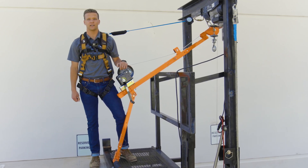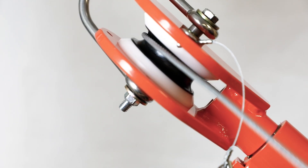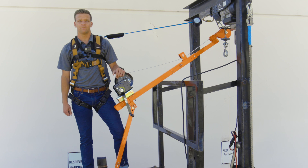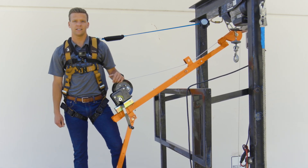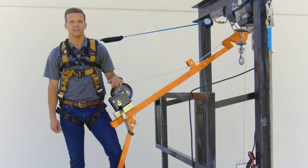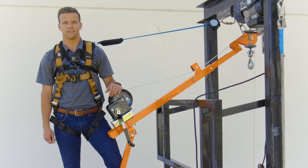Adjustability allows you to work in any direction, any angle, due to the swivel of the head. You can use it for both vertical and horizontal confined space entry and retrieval. It can accommodate a wider range of confined space entry and exit applications when you have access to an overhead anchor point, as compared to the davit and the tripod systems.